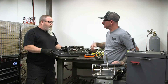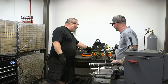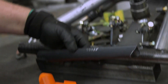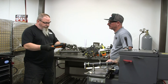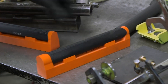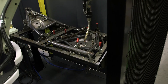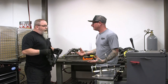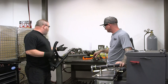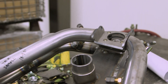And this is all done in-house. So once you get this part, the next step is they break it down into individual components. We print 3D printed check gauges so we have the consistency of each tube when we're notching them, cutting them, to make the part fit together properly for those robots to weld. They are very precise, but you've got to build a fixture around the robot. One of the key components to robotic welding is consistent parts and consistent fixtures that hold those parts the same way every time.